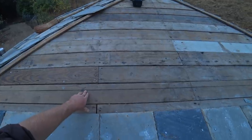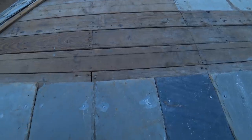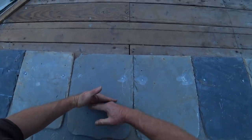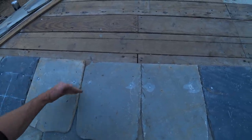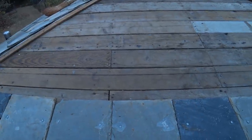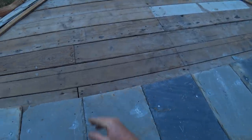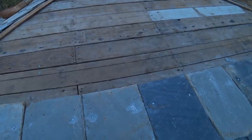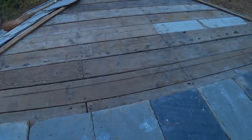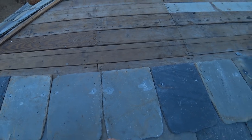I'm going to snap the chalk lines every five and three quarters inches, which is equivalent to the difference between the top of this slate and the top of the next - it's also the amount that the tiles are exposed. Each tile has five and three quarters inches of the bottom half exposed. That allows me to just go up the deck and snap a line every five and three quarters inches. By the way, the decking for this is 100% salvage two-by-six - there's fir, redwood, I think some hemlock, and a few pieces of pressure treated - just whatever accumulated around the place.